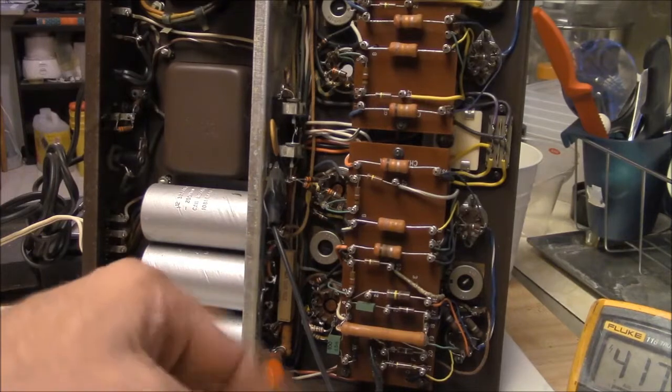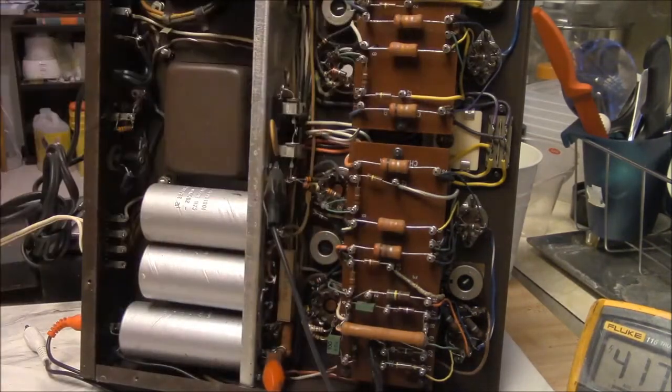Anything I do on this side of the amp, I probably ought to do on that side of the amp. So the parts I order, I really ought to replace times two, keep the thing balanced up. It's just good practice, because whatever I replace on one side is probably hot on the heels of being screwed up on the other side. That resistor is the biggest nuisance right now. I could use some new cathode resistors, probably some nice metal film ones. It's a little tight, not bad.